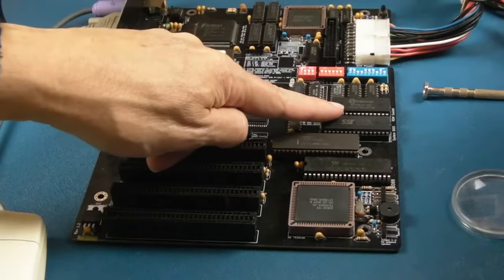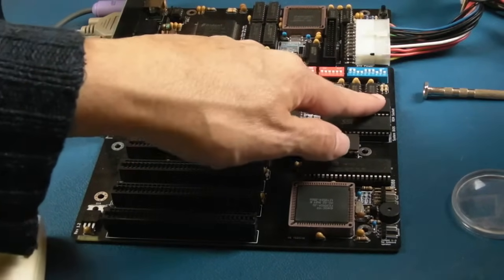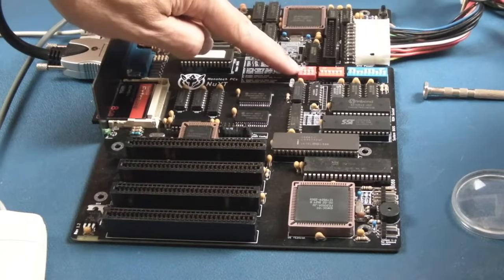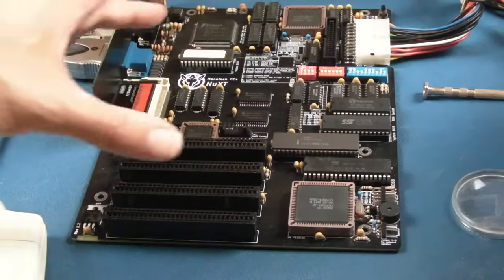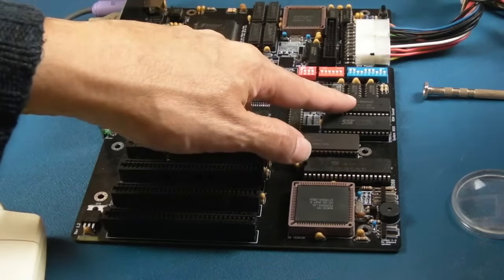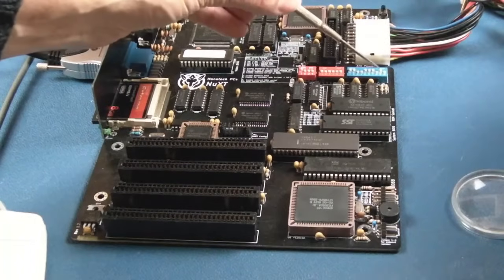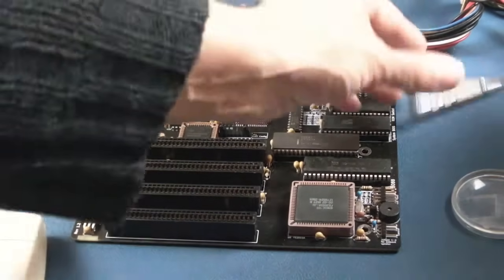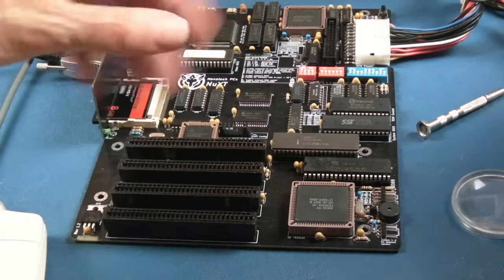I've used a W27C512-45 Winbond. These DIP switches here, the first one up sets it to D000, which I figure should work in this. It's default when it was down there, and you've got to have 9 up here to enable this ROM. It wouldn't boot, it just froze. It wasn't coming up with the VGA BIOS there.